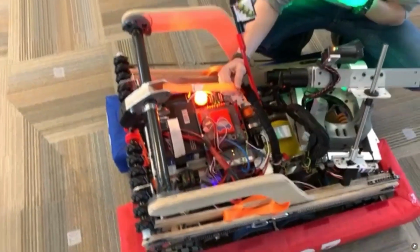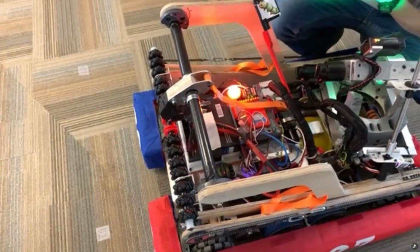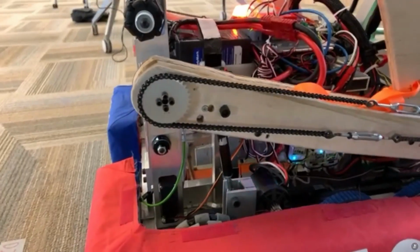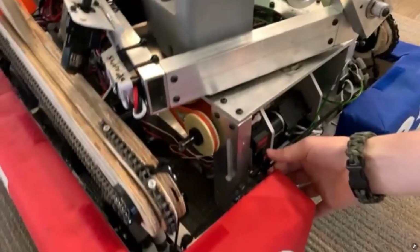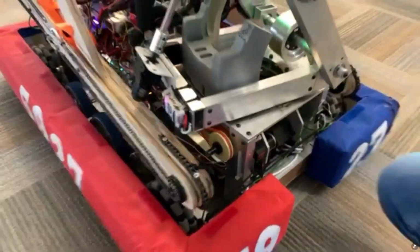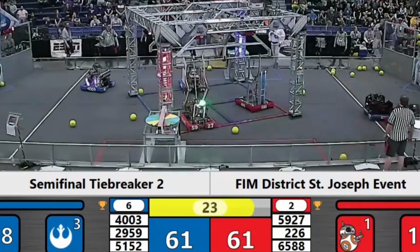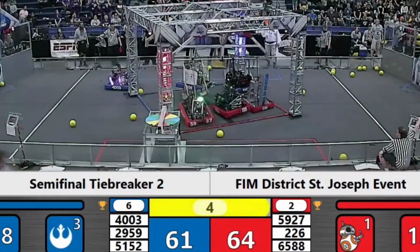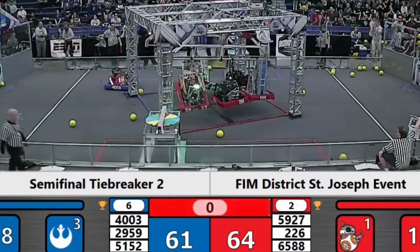No, the winch stays on the whole time, but the winch releases to bring the arms up, and the arms are powered by gas springs in the corner, so they automatically go up when released, because they are held in place by a servo motor in the very back of the robot that holds the ends down. When this thing releases, the arms shoot up as tension is released on the cable. And when they get to the top of their span, the robot drives forward and the hook moves to connect. And then the winch takes over all the rest of the work.